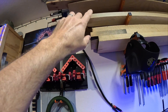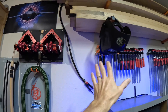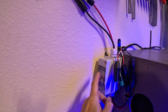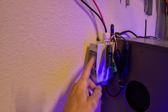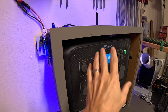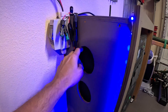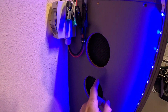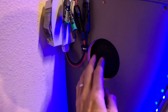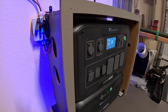You saw where I connected my solar panel cable coming down through my attic. I took all of this stuff off the wall, but here's my solar panel cable coming into my little DC circuit breaker solar panel cutoff switch, tied into the main head unit. I built this box, drilled out some four-inch holes for ventilation of the head unit, and put some window screen mesh in here to help protect it from sawdust in the shop.